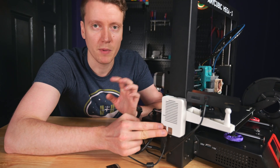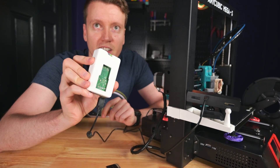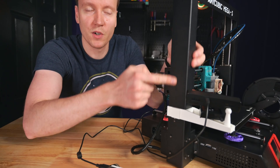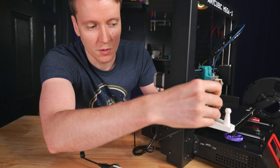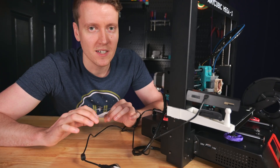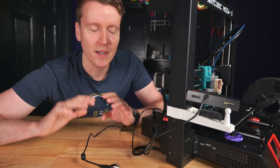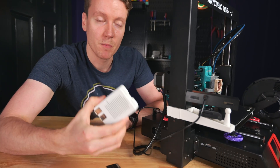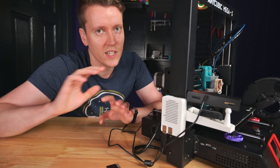This specifically is a Raspberry Pi 4, but Raspberry Pi 3s work just as well. I really like this mount because it's sort of a French cleat — the printer case can come off, I can take it wherever I want, and this arm just clips onto the metal vertical brace and also adds a place for your webcam on the front. The webcam is another great feature that comes with OctoPrint; it allows you to monitor your prints from anywhere and check that things are working correctly. It's so much easier to just open your phone and check if your print is working, rather than walking into the next room. This was just a webcam I had laying around — you could also use a Raspberry Pi camera. If you use your printer at all, I would highly recommend setting up OctoPrint. It's really not as hard as it may sound.